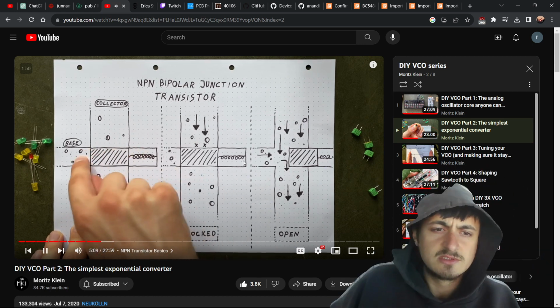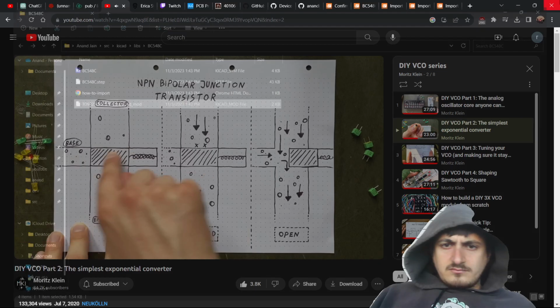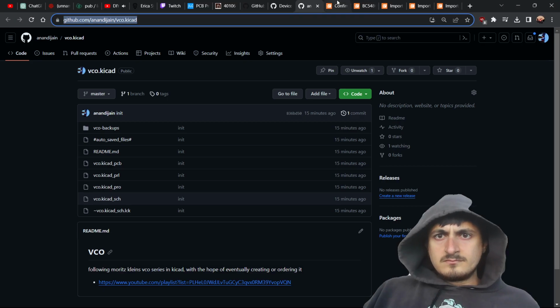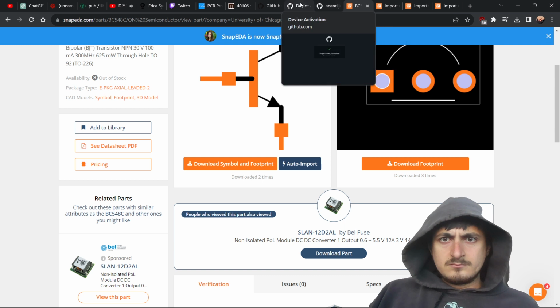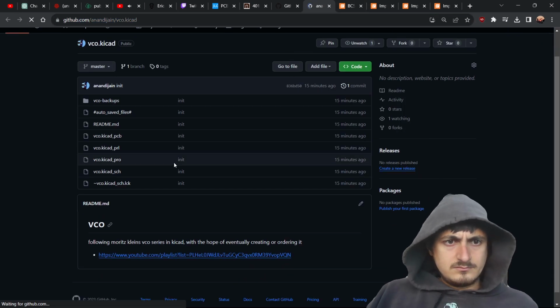But it can move horizontally, though there is a spring mechanism holding it in place. So pushing it in this direction requires some amount of force. With that in mind, let's check out two possible scenarios. First, imagine that there's a pump pushing water downwards from up here, while we are keeping the pressure levels neutral here and here. Since our seal is blocking any water from flowing in this direction, we will only be raising the pressure at this point.